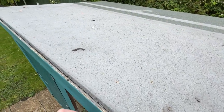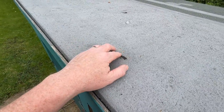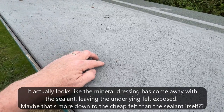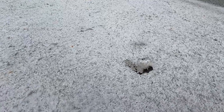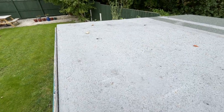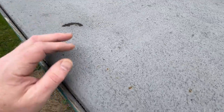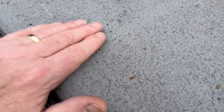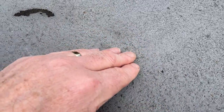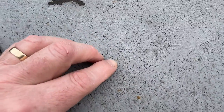However, just coming up now and having a look, we can see in patches where it has come off. You can see the felt covering showing through, so it looks like the sealant has just come off. There's another patch there. I'll have a closer look at those in a minute when I move the ladder. So we can see that the sealant is starting to - is it going brittle or is it shrinking? Probably it's shrinking. We can see traces of the felt roof below it.